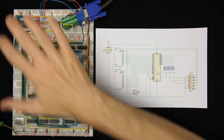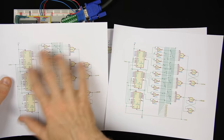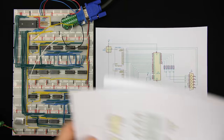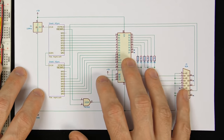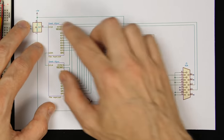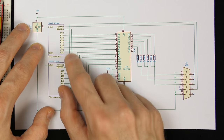What we've got so far is just generating a static image. The way this works is we've got some circuitry generating the horizontal timing and some other circuitry generating the vertical timing. At a high level, looking at the schematic, we've got a horizontal component and a vertical component, each of them with a binary counter that's just counting what pixel we're on. The horizontal will count from 0 to 100 because we've got 100 pixels across.